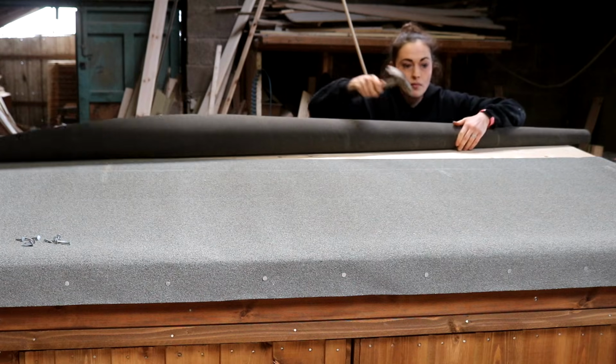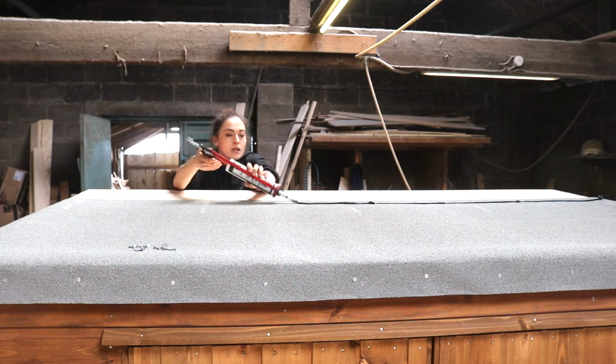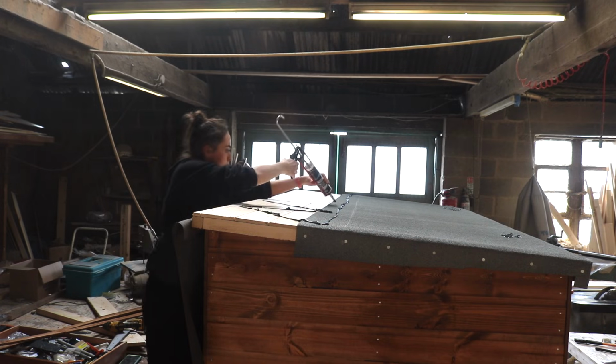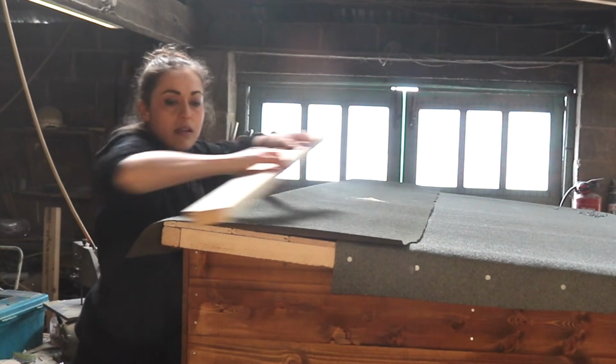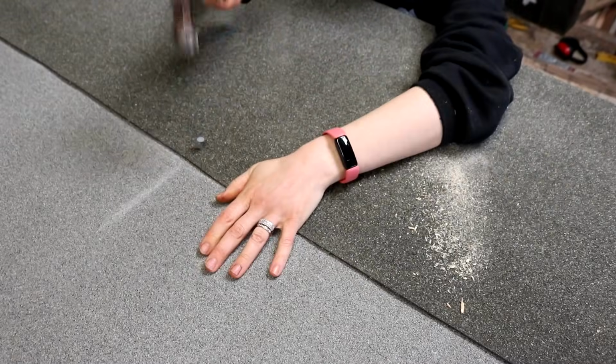Then pulled back the top bit, applied roof bitumen just along the inside of that hammer mark, and a zigzag shape before putting it back. Pressed it down with a plank of wood and nailed one clout nail on the shorter piece in line with those spar marks.